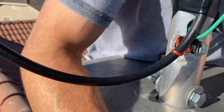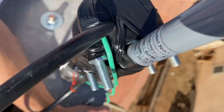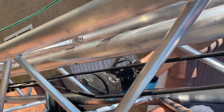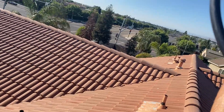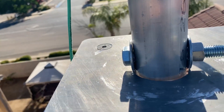Here's the LMR cable with the lightning arrestor, which goes up through the system. The ground wire and the cable come up through the center of the pipe, wrap nice and big around. The grounding cable actually comes through the pipe — you can see we've got all the excess hanging out right here, and there's our antenna. Pretty simple and straightforward. We use this big old half-inch bolt as a stopper to prevent everything from slipping out.